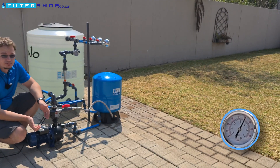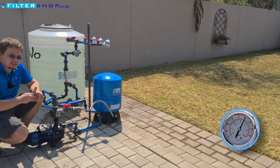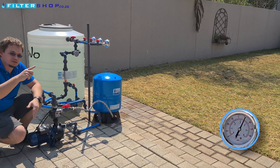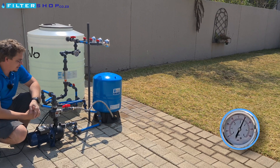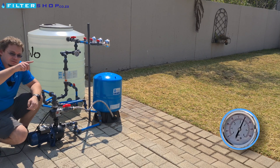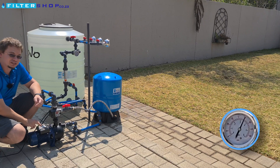The big advantage you get with this is the pump only runs at its maximum power while it's filling the tank, and then if it reaches its pressure target, it turns off. For a while you're just drawing water out of the buffer tank instead of having the pump run constantly. It dramatically reduces the number of times the pump cycles on and off, extending the pump's lifespan.